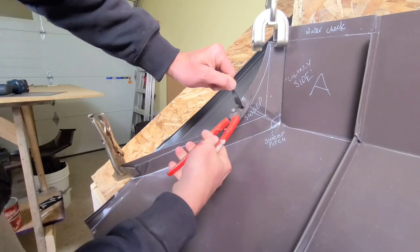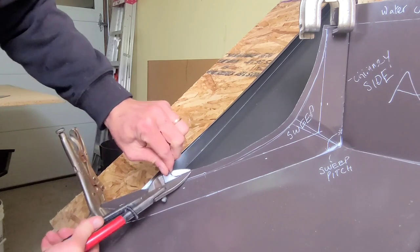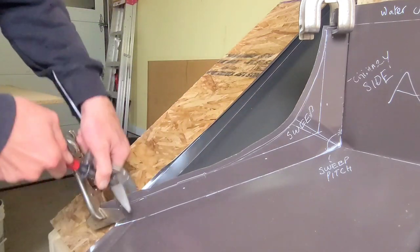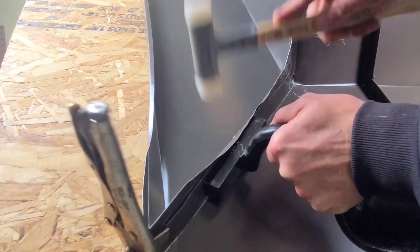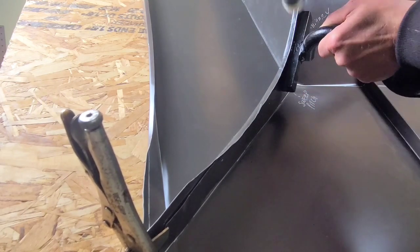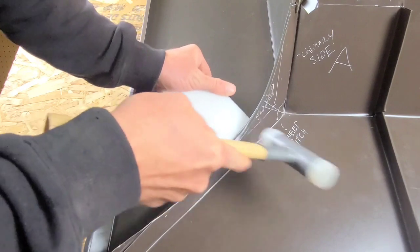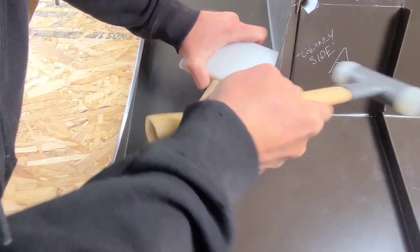You can see we've left enough material there to now come in with my curved snips and cut away that excess material. I strongly recommend picking up a pair of these curved snips — they have left and rights, link's in the description. We're going to cut this down — make sure it's around the three-eighths of an inch mark. That's a nice measurement to be able to fold over for a double seam. I'm going to deburr here with the mouth of my snips. Once that's taken care of, I'm going to start peening over the single fold to start the process of a double seam. The three-eighths of an inch allowance is quite nice because it actually stretches and folds to the shape of that sweep.